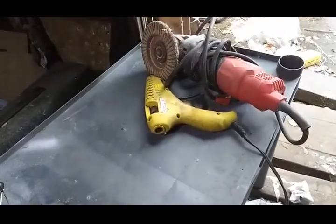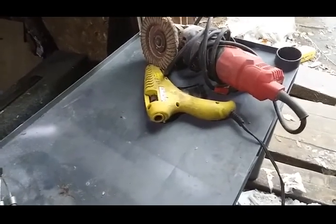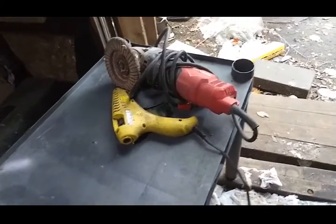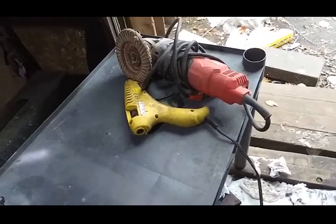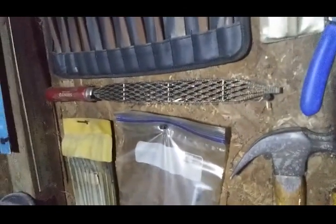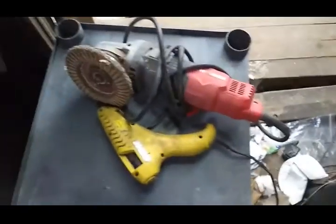The only other things I don't really use much are the hot glue gun — I used to use it on a few things but nowadays I'm doing everything with CA glue. I've used the angle grinder to do the truncated trapezoid profile on some eBay necks. It's very aggressive but does save time. Usually I'll start with the rasp, and three-quarters to four-fifths of the time I'll just do it all with the rasp. If I'm impatient I'll grab the grinder to take off a bit of material first, then go to the rasp.